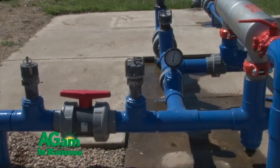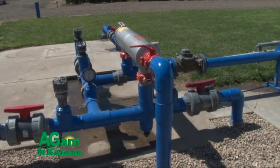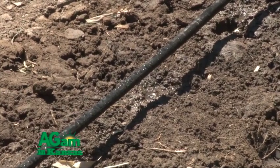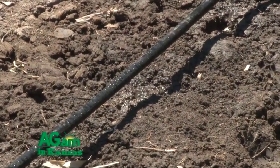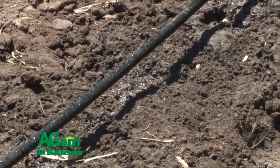There's one essential that has to be covered wherever you are using SDI, and that is assuring that the quality of water you're running through the system is up to specs — that's for the long-term maintenance of the system itself. That's right. When we first started this 25 years ago, water quality issues were our biggest concern. In fact, clogging of drip systems — whether subsurface or surface drip irrigation systems — is still the number one reason for failure in the world.